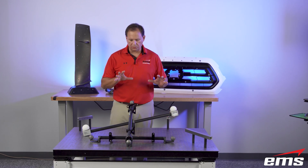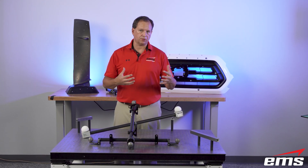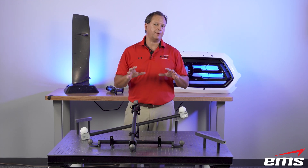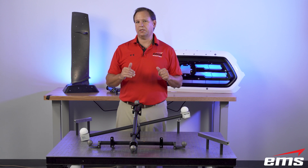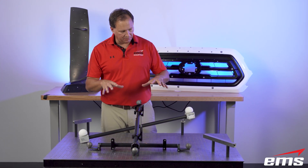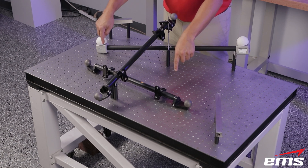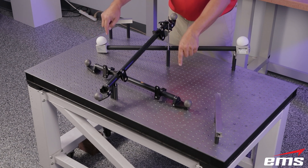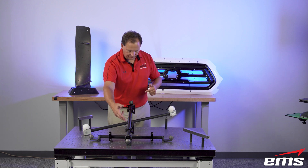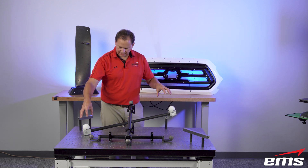Let's talk about the layout of what we have here on the table. We'll start and do 3D scanning with the MetroScan — it does both 3D scanning and 3D probing. We're not going to go into how the system works; we've already got an in-depth detailed demo of the new MetroScan system linked below. What we have here is a series of ball bars. We've got a ball bar going this way with two spheres and two cones, so we'll be able to do scanning and probe the cones to get center points. That one is about 25 inches to the sphere centers, one going left to right, one going front to back with some elevation, and a longer ball bar on an angle going up.